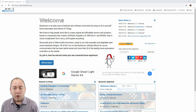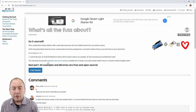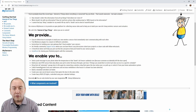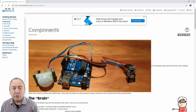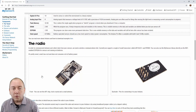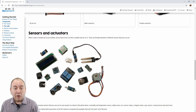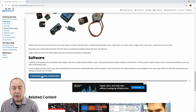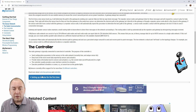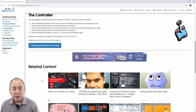The real magic of this switch comes with how it wirelessly receives commands. I'm using the MySensors library to provide the wireless communications. MySensors is an open source hardware and software community focusing on do-it-yourself home automation and Internet of Things. MySensors allows you to create your own sensors and actuators based on components like Arduino, ESP32, NodeMCU, Raspberry Pi, and the NRF24L01 transceiver, which is a single board that provides 2.4 GHz radio communications. By attaching an NRF24L01 transceiver to the Arduino, it can receive commands wirelessly from a gateway with a matching transceiver. MySensors defines a protocol for sending messages between the gateway and the sensor node. I plan to make a video that goes into more detail on MySensors, so look for that video soon.